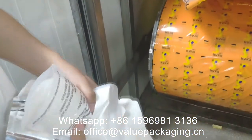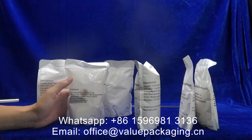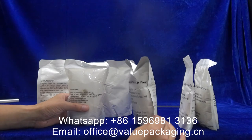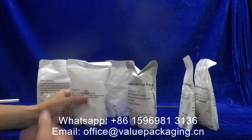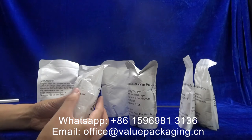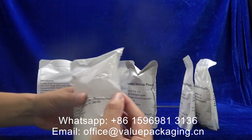Now I put them in the bag. For this compostable package filled with bleach powder and put in the room at temperature 42 degrees for a month — as the bleach is easy to be decomposed into small molecules, it caused the package to be expanded. There is high pressure inside the package, which caused air to burst into the package, and there are some small holes.